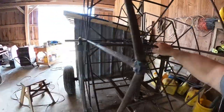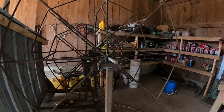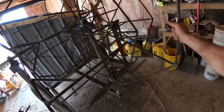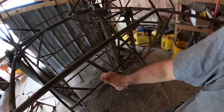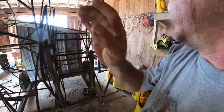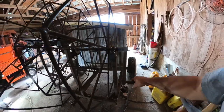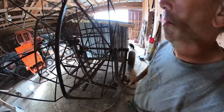We have it on a 40-inch diameter. The pipe will wrap on the outside of that — for inch-and-a-quarter pipe you don't want to go much less than 40 inches because you can't get it curled in right. The bigger one wanted to flex back and forth so I put bracing on every other one on the outside and one in the back. This is the little pipe reel for three-quarter inch black plastic pipe, and I built a crank handle for it. Kind of reminds you of a ferris wheel!